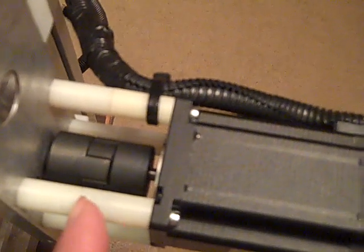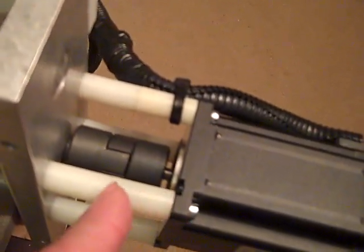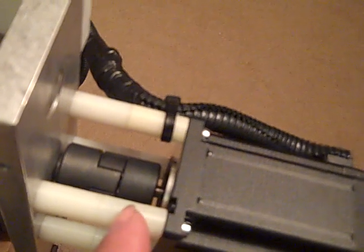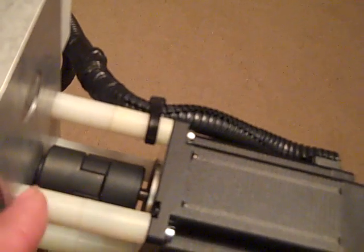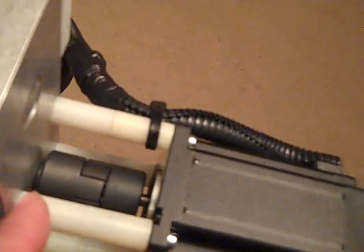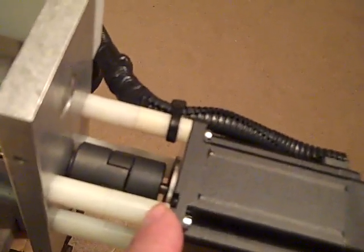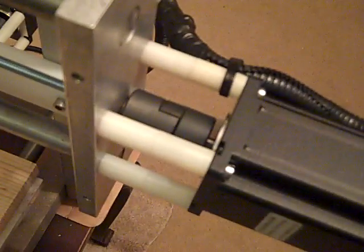These spacers are two-piece — they are split right here. These are 10-32 screws: this part is bored out so the screw passes through, and this part is threaded 10-32, so the screw goes into it from this side. This makes it very rigid because almost the full length of the screw is engaged within it. Adding four of these keeps the motor mount tight.